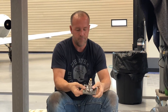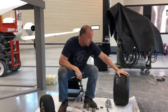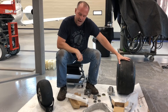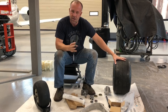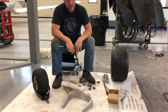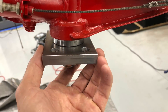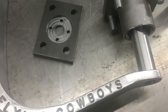I had to make a new adaptation assembly to hold it and an adapter plate - these two will go together and I need to weld those up. With this bigger wheel it's going to shimmy like crazy. I already had a tail wheel shimmy problem; I had to tighten it too tight where it had a hard time steering - borderline shimmying or borderline tight. On this bigger fork it will make the problem worse, so I'm going to make it turn easily and then put a steering dampener on it. Spacers done, forks done, assembly done - let's put it together.